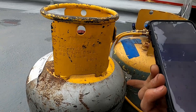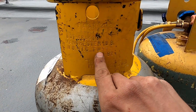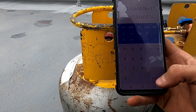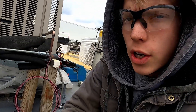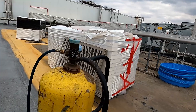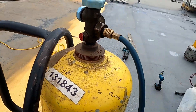Now, you're going to be weighing the entire jug, so unless you tare out that first weight — the TW, tare weight — which is 27 on this one, you're going to add 27 to figure out your total weight on the scale. So when this thing is full, it's going to weigh 67.31 pounds. Even though it could technically hold more refrigerant, it's never allowed to be more than 67 pounds for this particular cylinder.